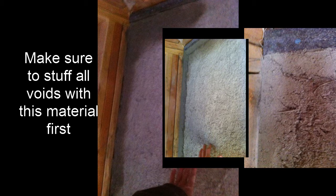So I did a test on a small corner that butts against a post and a top ground, wetting it down first. I made sure to fill the voids already present with the sandy mix. You can see these voids as deep black lines by the wood on the far left photo. This is an important step to keep the integrity of the material. I used the sandy bevel to eyeball a straight line for the finish level. I also made sure I created a valley at the corner to make the next plastering step easier. Can you see it? It's a standard Japanese maneuver.